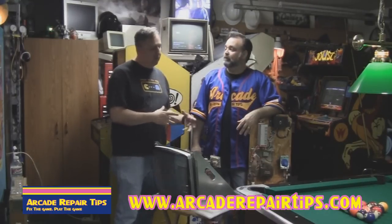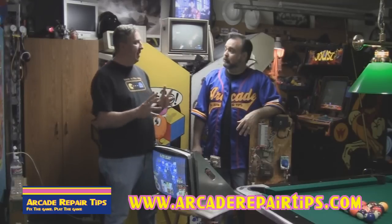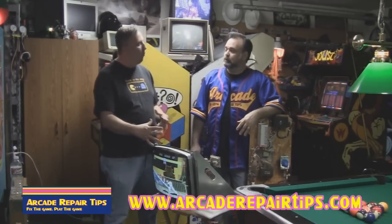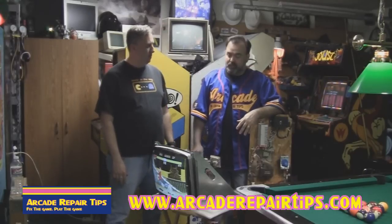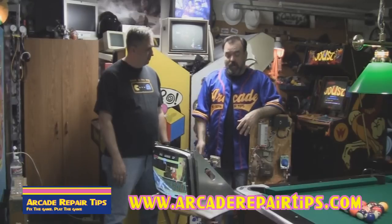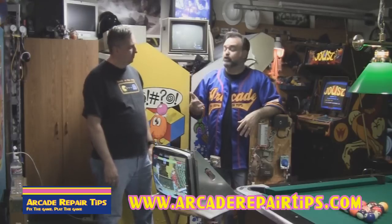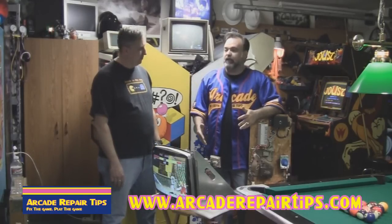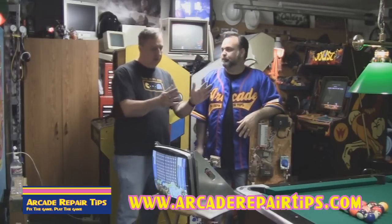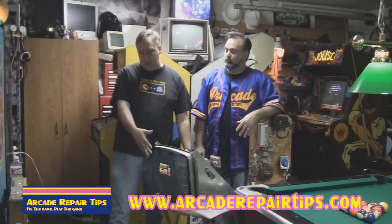We went back and repeated the same process for the other two guns, then hooked back up the monitor. It looked great, looked a lot better, but it wasn't adjusted or anything yet. Before we started, Stan had taken the monitor back to kind of its default settings - turning all the drives down, the cut-offs, contrast, and brightness down to about where it would have come from the factory. So that when rejuvenated and put back in, we would get an accurate cleaning and rejuvenation. We didn't want the red turned up and then try to rejuvenate and show the red is high. He adjusted everything to the middle, did the rejuvenation, then came back with the monitor adjustments. The end result looks fantastic.